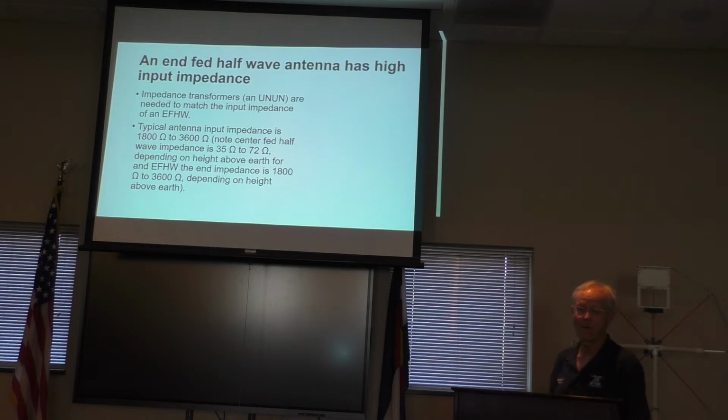Yes, sir. When you share that 8-to-1 balun, what's the difference between that and an antenna tuner? Are there different ends of the spectrum as far as the SWR on the dipole? Well, if you're talking about a current choke or voltage balun or a current balun, that's not really designed to tune to match the impedance. It's trying to knock off that common mode current to avoid having the antenna radiating down your feed line or picking up signals trying to run it through your shack.